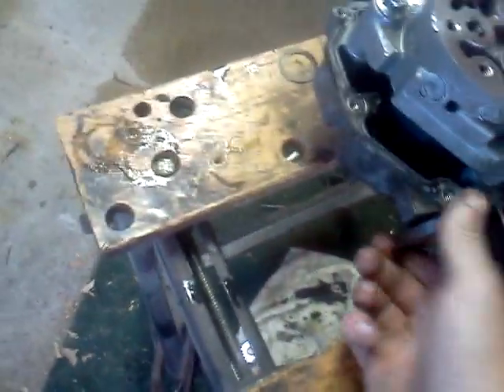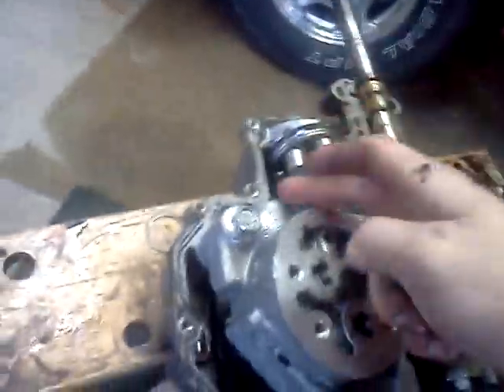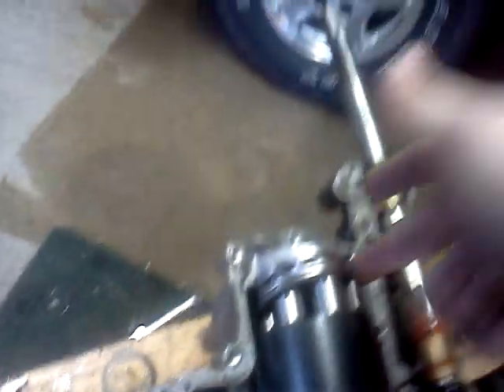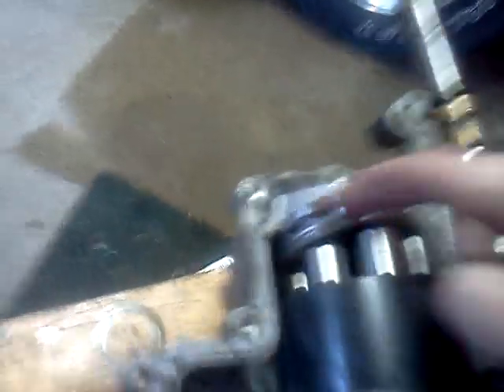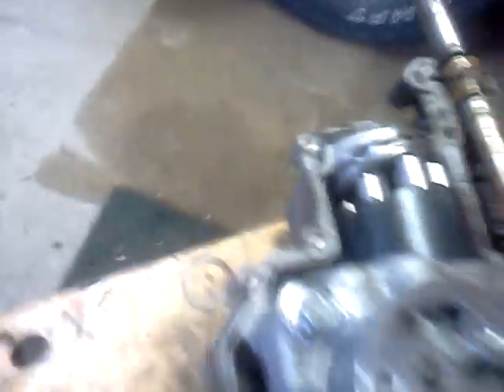Now in reverse, it's all the way down. This way is forward, this way is reverse — it's hard to see because there's no lighting up in there. It does the opposite, which will make it spin backwards, giving these ones power which will force it up this way. These are just roller bearings that spin freely — just a bunch of balls all the way up in here. That's what those ribs are, to hold the balls in.